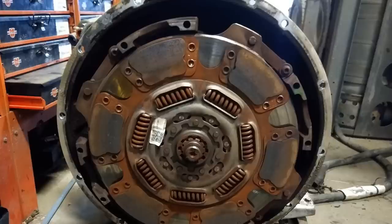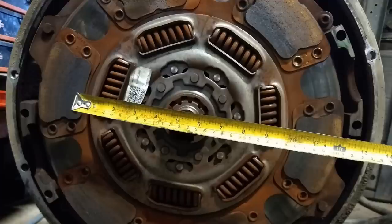We have a flywheel we have to use on this engine, and it's actually off of a CAT 3406, which is an older variant of the similar class of engine that CAT has made. Most of the dimensions are the same — bolt pattern, diameter, number of teeth for the ring gear, all that fun stuff. The biggest issue is that when you try to use a modern clutch, what we found when we tried to reuse this flywheel before was that the hole in the center is actually too small to allow the torsion springs and center hub assembly of the clutch disc itself to fit in, so you get interference issues.